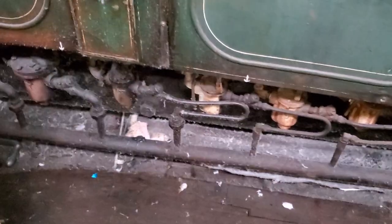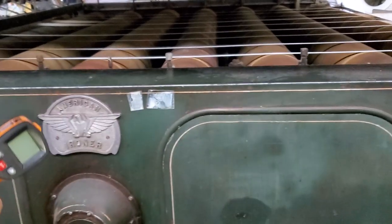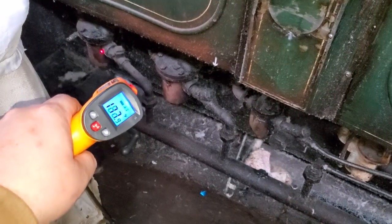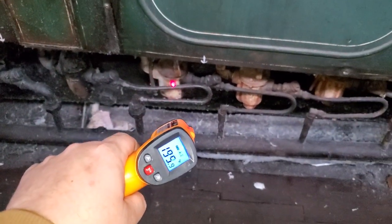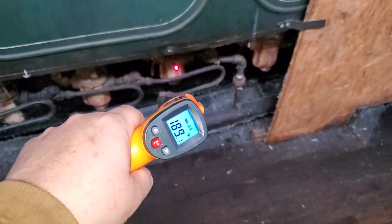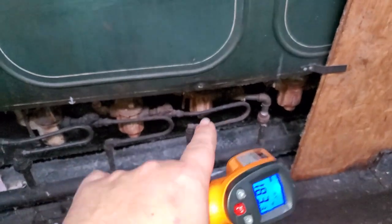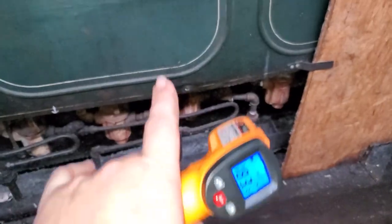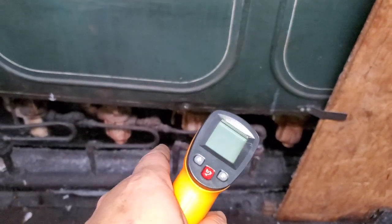If the chest wasn't hot enough in one area, the next thing to check is the steam traps on the return line. If something is stopped up inside a steam trap it will prevent the chest from getting hot in that area. The best approach is process of elimination — check each trap: 188, 190, 188, 194, 191 degrees. If you get to one with a substantial temperature difference, that's the problem trap — you'll need to unclog it or rebuild it.